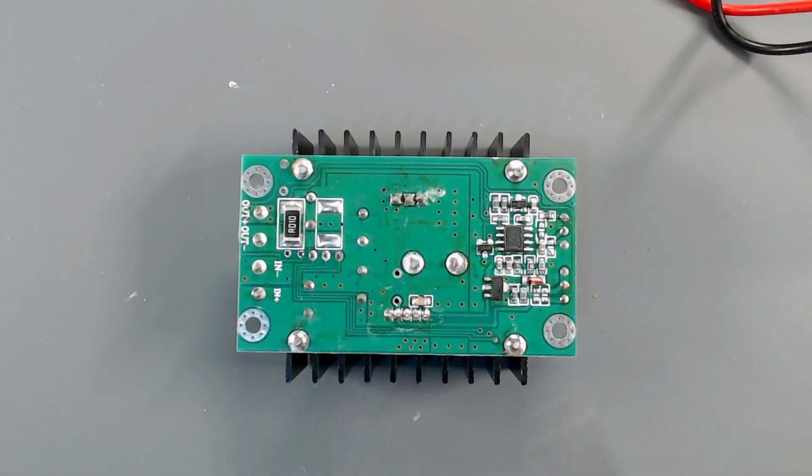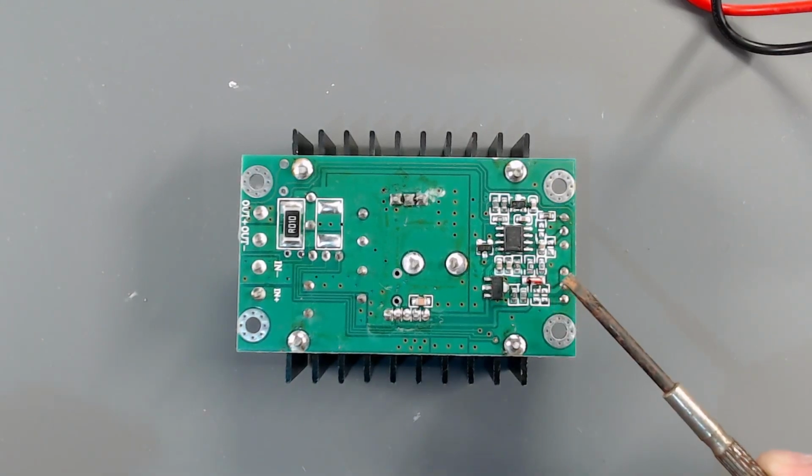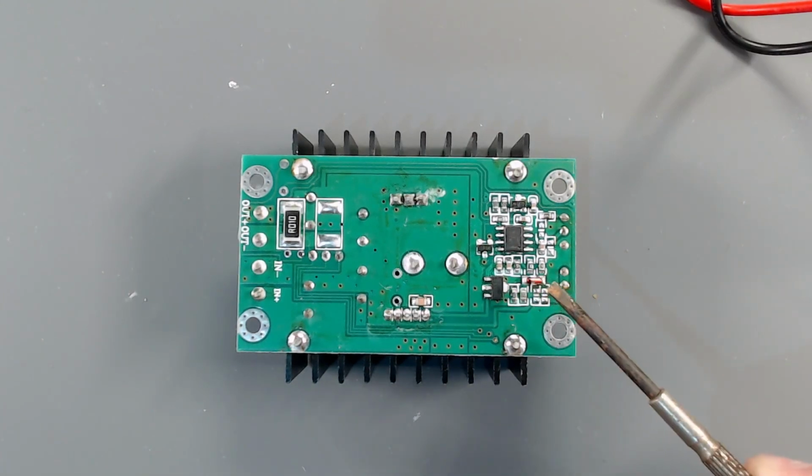So this is basically the circuit that you have on the underside. This is clearly the control circuit. But how can you mod this if you can barely understand what's going on? And most importantly, how can we effectively design an on-off control that doesn't just plug and unplug the controller? You have inrush currents, you can have a load plugged into your power supply. That button or switch will take a lot of amps in and out every single time. So it's important to try to control this buck converter without plugging it on and off the main power supply.